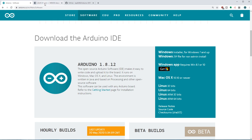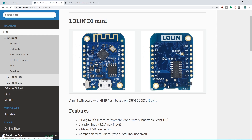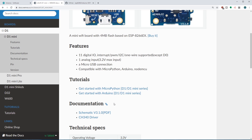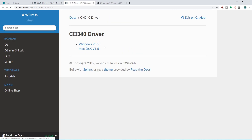Next thing you're going to want to do is — the D1 Mini has a CH340 USB to serial chip on it, as does this Chinese clone that I have and am making this video with. So the second link in the description will bring you to the page where you can find the CH340 driver. Now if you already have Chinese Arduino clones, a lot of them do have the CH340 so you may already have this installed. If not, just download it, extract it and install it. Really simple. I did it on two Windows 10 machines now so no worries with that.